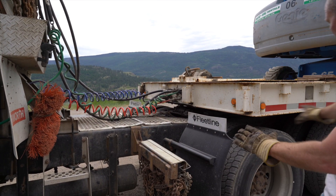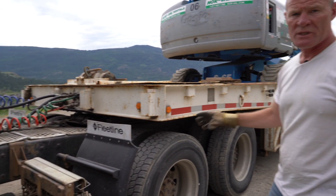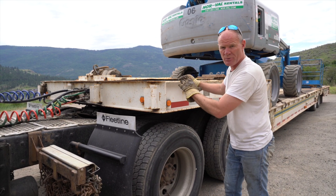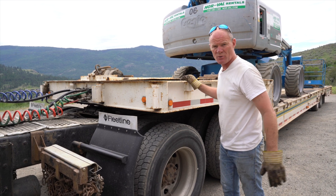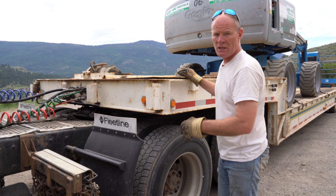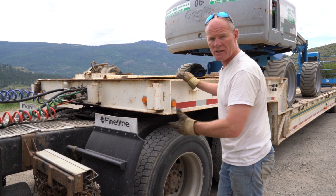Now, hooked up — everything's here. You would say to the examiner, after you're finished, if this was a new trailer, I would do a complete pre-trip inspection on the new trailer — that's what you would do for hooking up to a new trailer. So that's your last step. Otherwise, we're hooked up and we're ready to go.